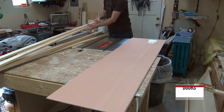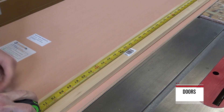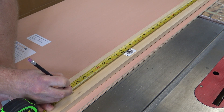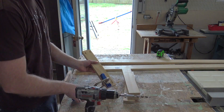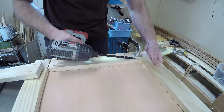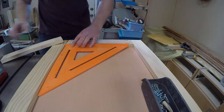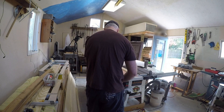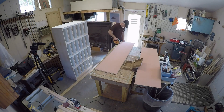A last-minute addition to this project were some doors, so I decided to do something a little different. I used a piece of Luan and some pine to create a frame, and here I'm cutting them down and getting them to the right dimensions. I used a Kreg jig for this just because I wanted to keep it simple and didn't want to see the fasteners or any nail holes — more things to fill. Once that was ready, I flipped everything over, attached the Luan to it, and used my stapler to attach the back to give it a nice rigid form.